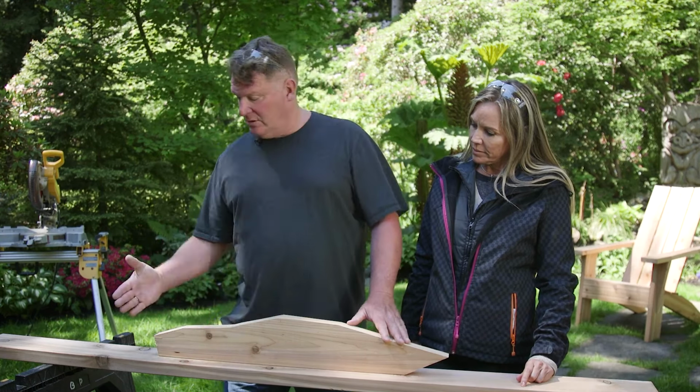What I normally do is I cut this angle first, and then I take all my measurements from here and lay it out. Just take your time laying it out, because once it's laid out properly, it's really quite easy. After that, I do all my through cuts first. A through cut is when you're just running your saw right through these 4 cuts.